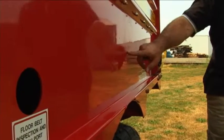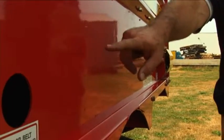The key to the longevity of our TD460 conveyor belt is that the belt does not hold the weight. The weight is held by large-shaft, triple-sealed, non-greasable bearing rollers. There is almost no friction at all as the belt moves across these rollers, conveying the material to the back of the machine. This means less work for your tractor, more efficiency, and less heat produced by the hydraulic pumps on your tractor.